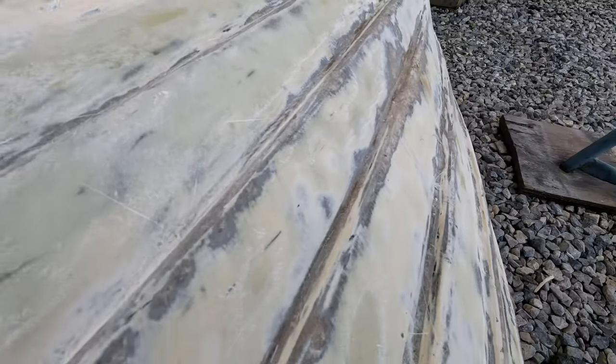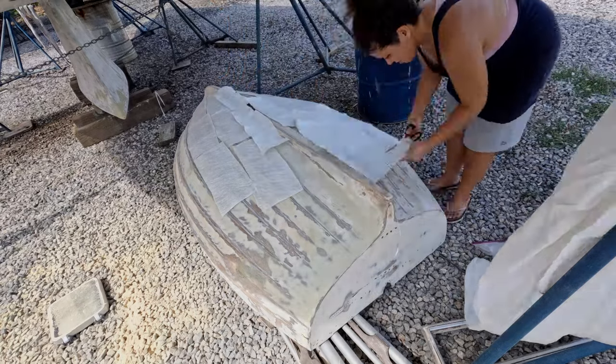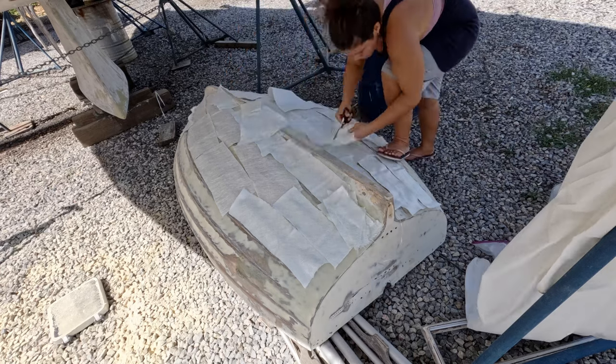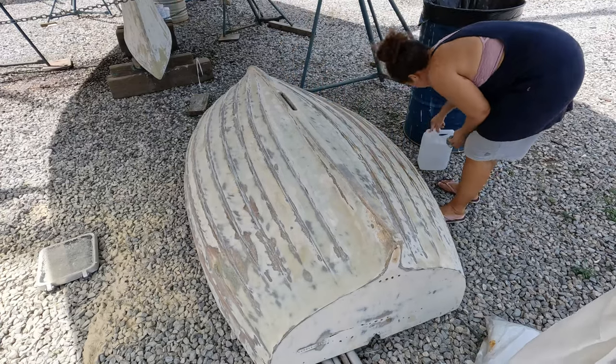The problem with grinding was it just kind of made the grooves of the dinghy wobbly. Obviously there are cracks along all of the chines, or all of the ribs of the dinghy, which is what we were fiberglassing it for. But seeing these areas that are potential for voids, what I should have done in the first place was fill the grooves with fillets of epoxy. In Guatemala, it's not easy to find light and thin fiberglass cloth that will adhere easily to the shape of our dinghy. The superficial lap-strake shape and the thick cloth were turning out to be a bad combination for this project.